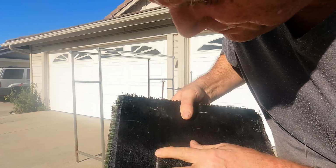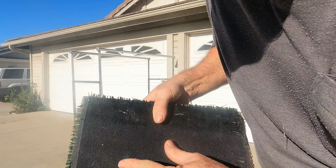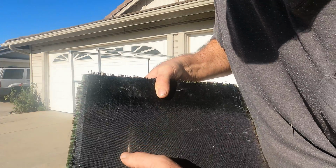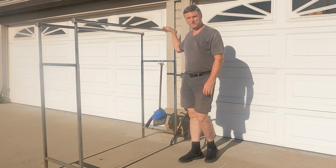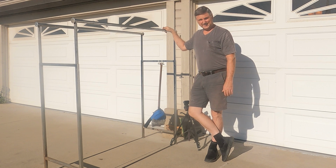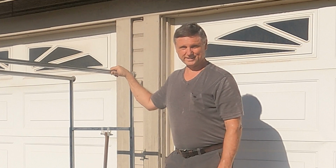Like before, the outer layer of epoxy on the outside gets pretty much crushed, but it gets down to the basalt layer and there isn't a slice in there. So it doesn't really seem to matter if I put a sharp axe on it and hit it with 25 pounds of lead bringing it down. Both did really well. The basalt did slightly better again.